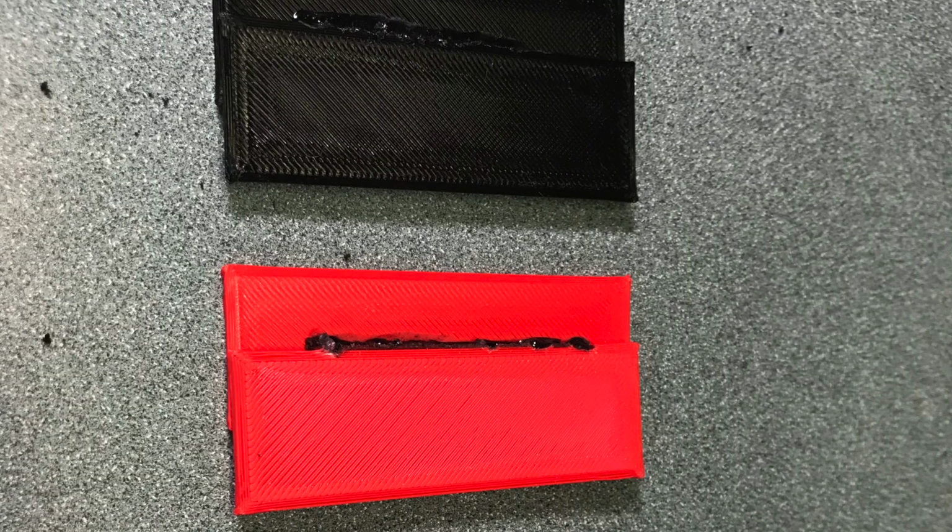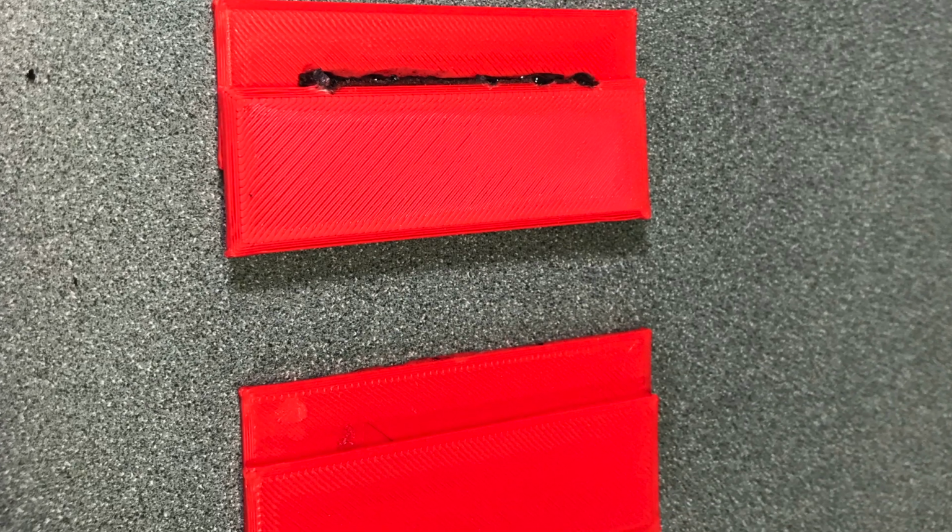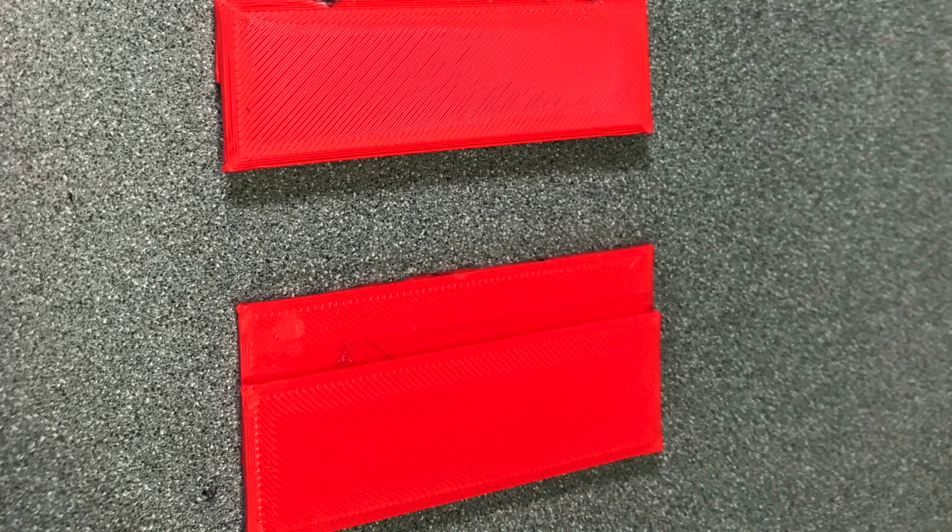There's really only two viable options that I found here: the plastic welding with the rotary tool and a Gorilla Gel CA type glue. As you can see, the PLA glue sticks were quite a fail for me. I was using a high temp glue gun, but it really didn't make a difference. It did not get hot enough to melt the PLA and really get any kind of fusion between the parts. Now, maybe there's a higher temperature glue gun you could use, but for me, I really didn't see that to be a viable option.